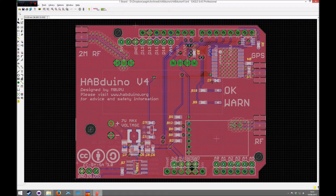That's important because if you duplicate this board, the actual names of the components will increment. So for example, that on the next board will be something like C10. And if you send a bill of materials to your assembly plant and you say C2 is a whatever capacitor, on one board it's going to say C2, on another it might say C10, on another it might say C20, etc, etc. So by running panelise.ulp, it actually just makes a copy of the name, which doesn't increment when you duplicate the board, and that's quite important.